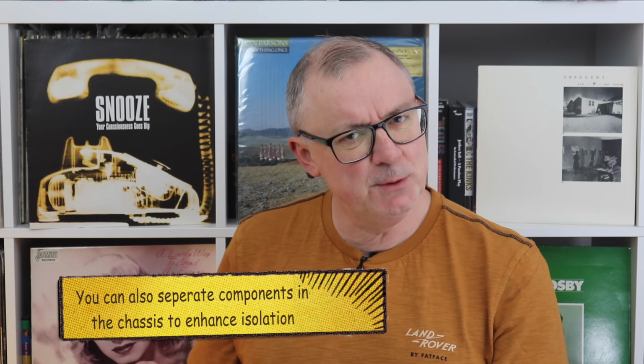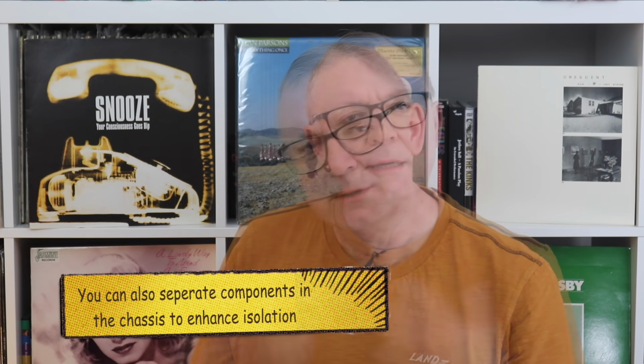In short, this allows each section to arrive in a larger chassis, potentially holding better quality components, because you have the space to hold them all. Separating the two parts of the CD player also means you lower the noise floor, because components are not forced to sit cheek by jowl, sharing vibrations and sharing electronic contamination and creating hot, high-frequency noise together. Now, I've said it before, but look, hi-fi is essentially antisocial. The more you separate hi-fi components, the better your hi-fi system will sound.